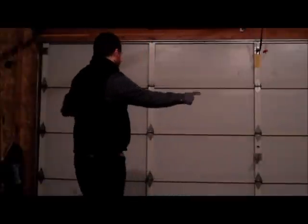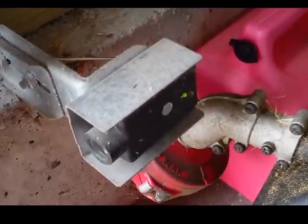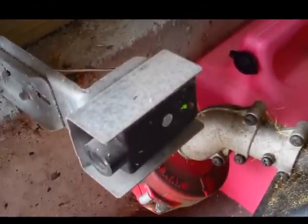What a safety eye is: there's a box on either side of the garage door that shoots an infrared beam across the bottom of it, generally about six inches above the floor. Their purpose is to stop the door from closing if there's anything breaking the beam coming in or out. The garage door opener will not properly function if the beam is either blocked, if there's no power going to it, or any of those types of things. So what I'm going to show you is how to check that to see if that's causing your problems.